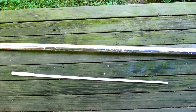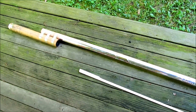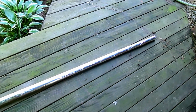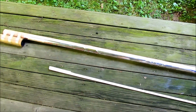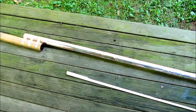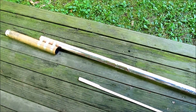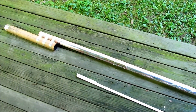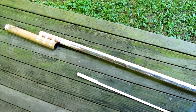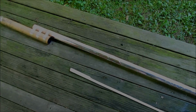That should result in a flat falling rocket like the Bang Fai makers do. So I think I'm ready to make another motor, and hopefully this Saturday I'm going to go get a piece of steel conduit to put this in as a launch pole. These things build up thrust relatively slowly. I want this all the way down in an 8-foot launch pole, so that by the time it leaves that launch pole, it's built up some speed and thrust and will still fly straight skyward. I will launch one of these with some smoke delay composition in it, like the test motor the other day, and see whether it falls flat to the earth or not. Film on Saturday or Sunday, hopefully.